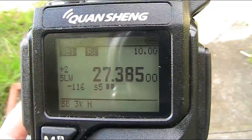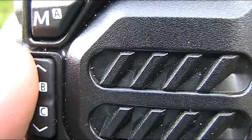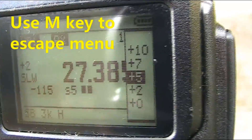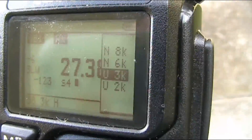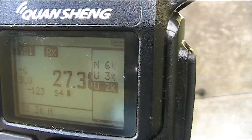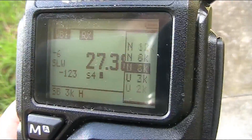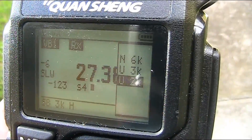The third point is to be aware of gain and bandwidth settings. Gain is a long press of button 4. As you can see, a little menu comes up, and the up and down buttons can be used to adjust it. Set it for not maximum signal strength, but best signal to noise ratio. While gain is button 4, a long press of button 5 gives you a bandwidth menu. For most HF applications, either 2 or 3 is the best, though there might be times when 6 gives more pleasant listening on a stronger signal. Having your bandwidth too high means that too much noise either side of the signal gets through and that can spoil reception.